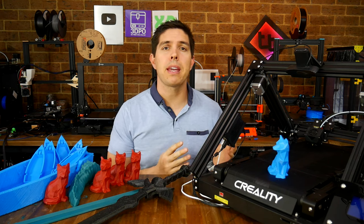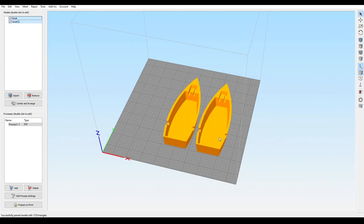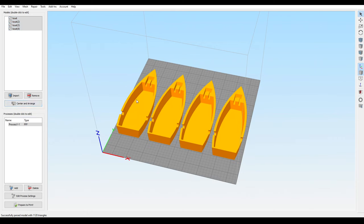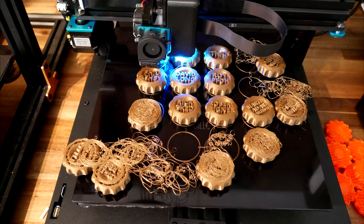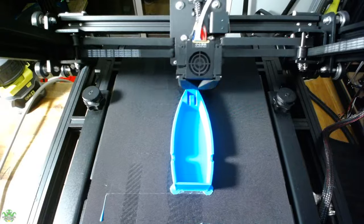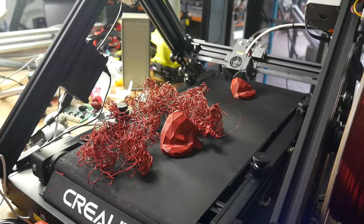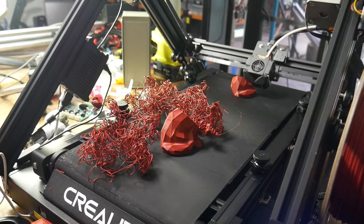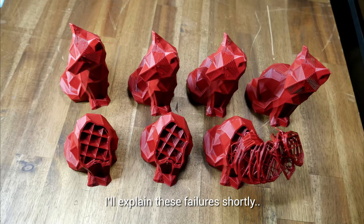The other thing it's really great at is pumping out parts repeatedly without any user input. Normally for multiple parts, we would fit as many as we could on the build plate and print them all at the same time. If one fails, it's likely to knock over the others and in a domino effect destroy the whole process. This printer, however, can print the next object without even removing the previous one from the belt, and in the event that some objects fail, it doesn't affect any print started afterwards. This makes multi-prints more reliable, and we also have the bonus that there's no stringing between our objects.